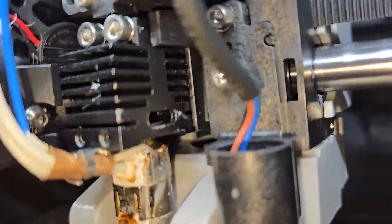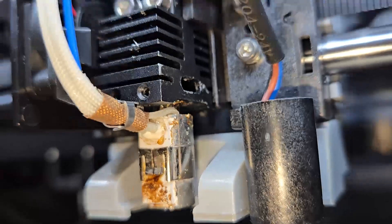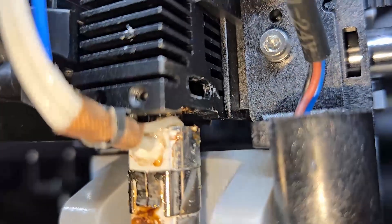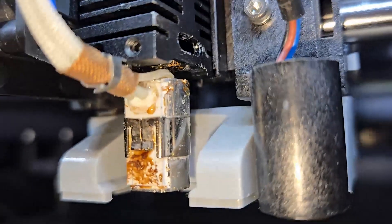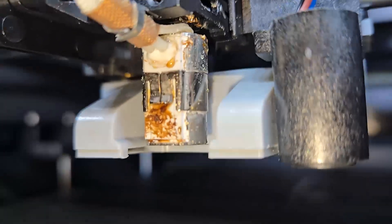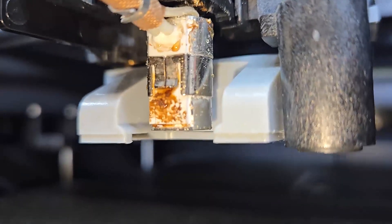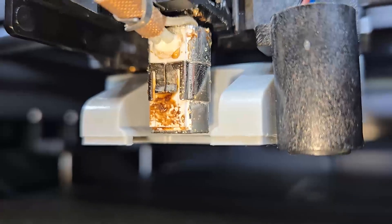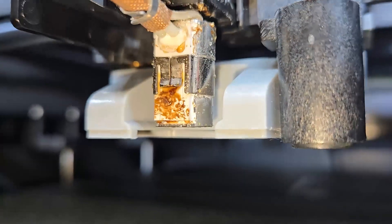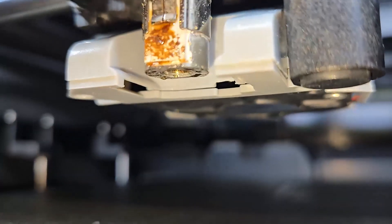Bear that in mind. If you see filament or plastic oozing out of this hole here, and especially between the heat sink and the heater, then that's your problem — the ceramic cracked and broke. You're not going to feel any kind of looseness. Odds are you won't feel anything at the hex head of the nozzle because it's still tight. And if you go to tighten it, you're going to hear the sickly grinding crunch of ceramic getting ground into little bits, and you can end up with that inside the nozzle.